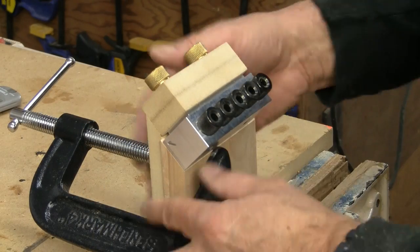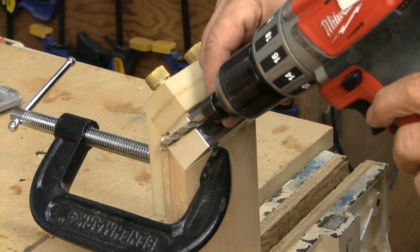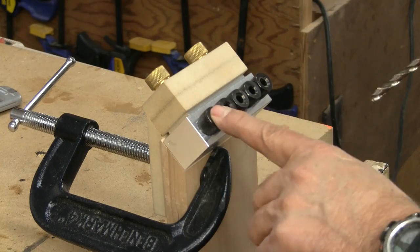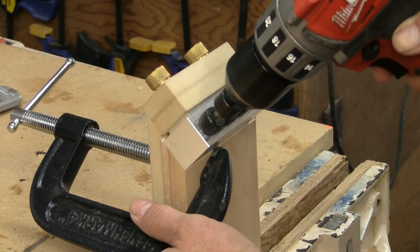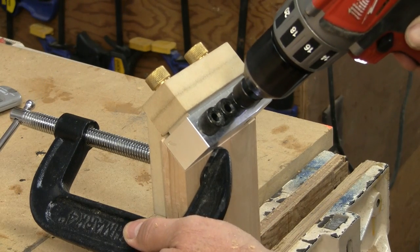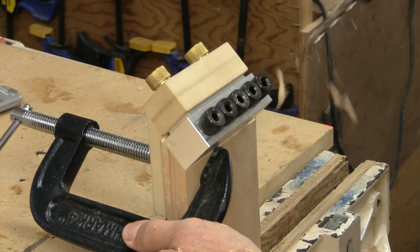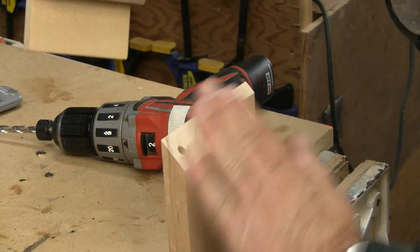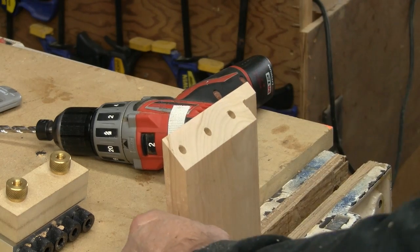So we've clamped that. It's nice and secure on there. I've already double-checked to make sure that the bit won't penetrate the 45-degree cut too deep. And we can go ahead. I'm going to make three doweling holes with this. There we go. Now I'm just going to carry on and do all of the other sides the same way,